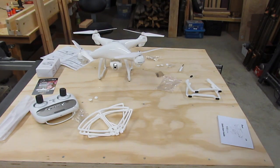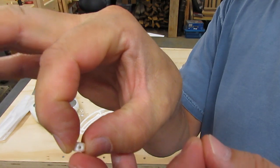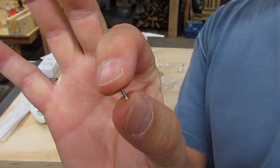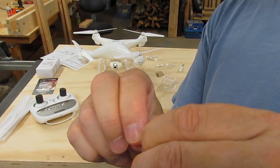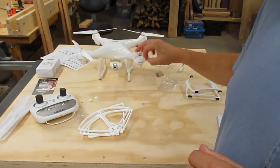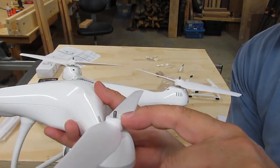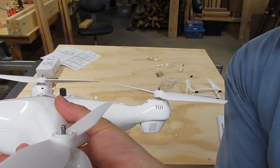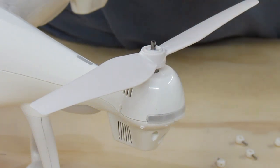I have these fixed spacers — they're like a collar. It's a little plastic bead with a hole in the side, and then these real little tiny screws. The screw goes into the hole on the side so this thing can work like a set screw. And then that goes on after the brass washer. There's a hole in the stud that the propeller goes on, and that's where that screw is going to go. The hole is bored all the way across so it can go in either side.